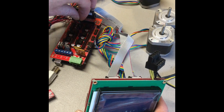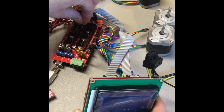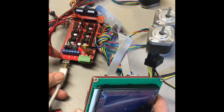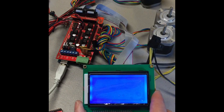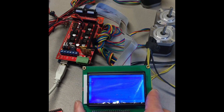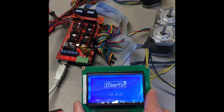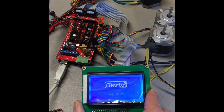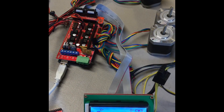On the graphical LCD which is the one you see here, the bottom temp is the actual temp and the top temp is the target temp. So I'm going to go ahead and plug my USB cable in. Now we're going to look at our LCD once it powers up and we're going to see if our hot end and our heat bed thermistors are both currently working. And you can see right there it is — so that's good.